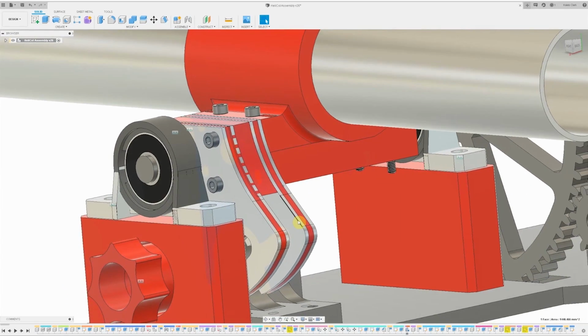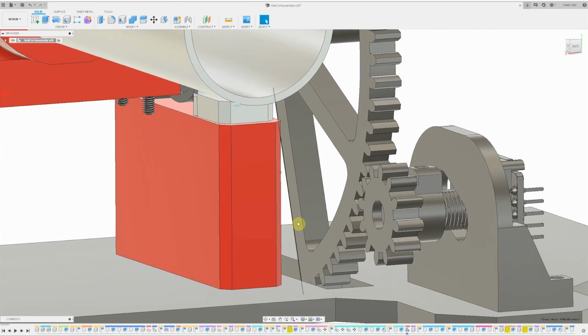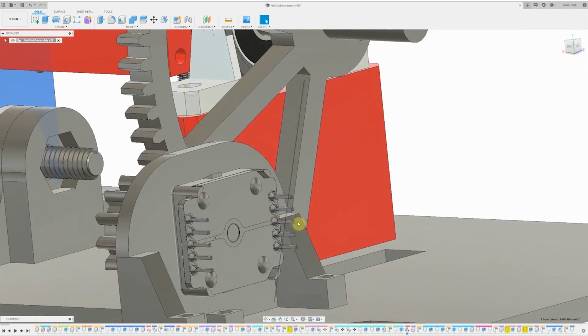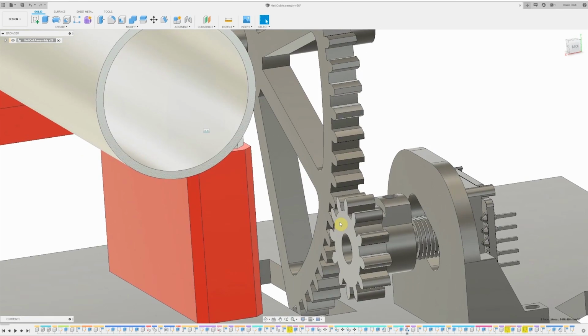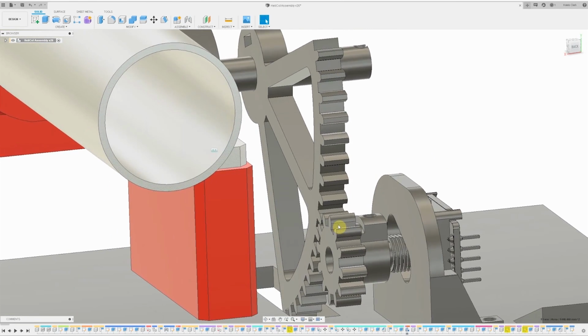Since it only rotates 40 degrees, that's not going to be enough data from the encoder to make it smooth. According to my calculations, I'm going to need about a 6:1 ratio on the pivot shaft to the encoder. I made this gear kind of an odd shape to reduce the print time. I hope that works. And then for the handle.